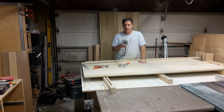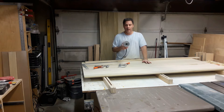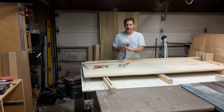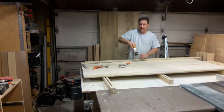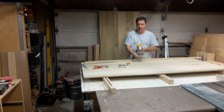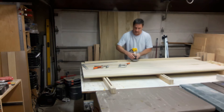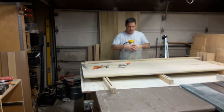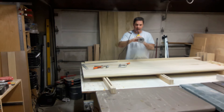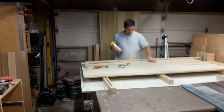This sled that came with the router is round on one half and square on the other, so I have to be very careful. Whenever I have this kind of base, I always use the round part, because it's the same dimension to each of the sides at any point around the rounded side. So if I turn the router a little, it's not going to give me a wobbly line. Whereas if I use the square part and turn it even a little, it's going to go right off and I'll get a wave or an offset groove.